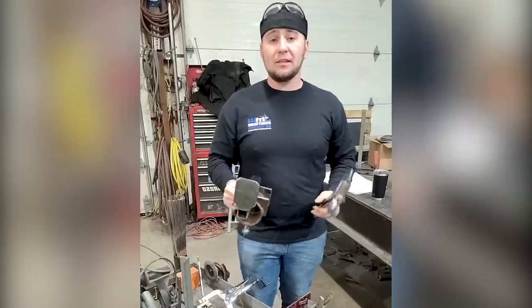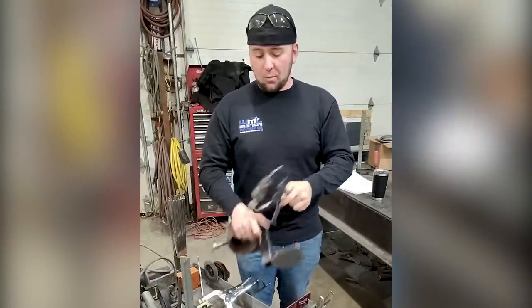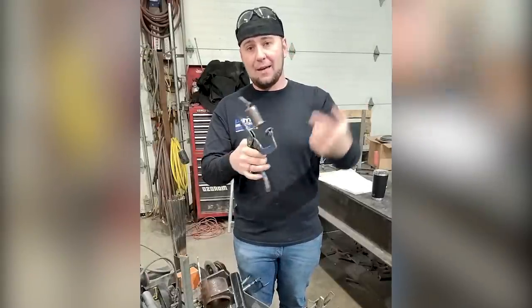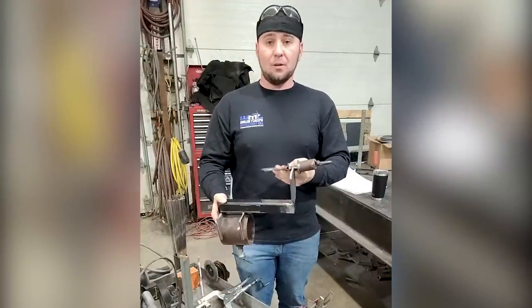In conjunction with this, since our treads have a bend down and a bend up, we made a custom vice grip clamp with a piece of tubing on it to compensate to go over top of that lip that comes up so that when we clamp it on, we can clamp it firm on both sides.